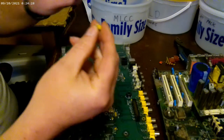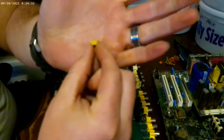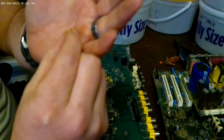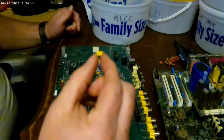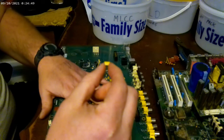Hopefully my camera will focus good enough on this, but you can see there's a stripe across the top of it on one side — that tells you it's the positive side. It's got a little plus in that break in the middle of the stripe, so that lets you know that's the right type of component. You have to look at the board where it's coded as far as what it is.